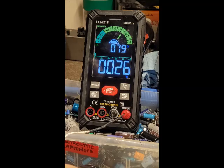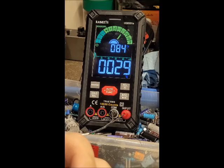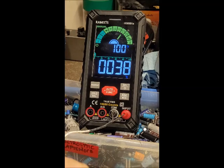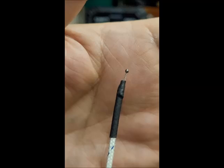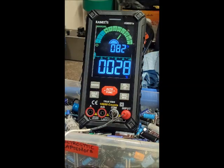IC 305 is 24 degrees, IC 307 is 25 degrees — so far all regular temperature. IC 306 and IC 302 are about 29-30 degrees. IC 316 — the regulators are a little bit warm at 35 degrees. The 8-volt regulator is 37 degrees — actually pretty cool. There's the sensor for it. Pretty cool, awesome.